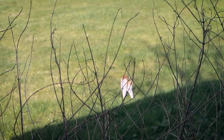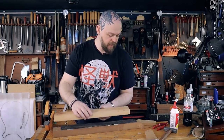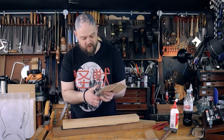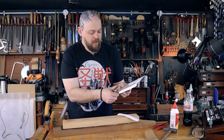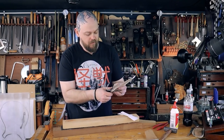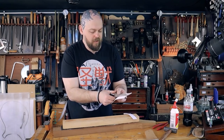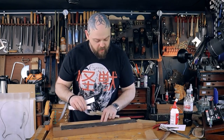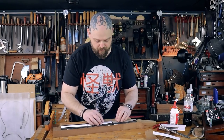Potentially, yeah. So this is a 12-inch radius block with cork on it. I am going to use that as a clamping caul. I'm just cutting some sections of cardboard here to go down the middle. This is more to stop the caul from breaking than anything else. Now, because the caul has got a radius in it, it means that I am clamping down on the edges of the fretboard alongside the neck, and that is exactly what I wanted to be doing. So that works there.